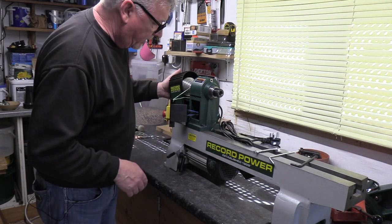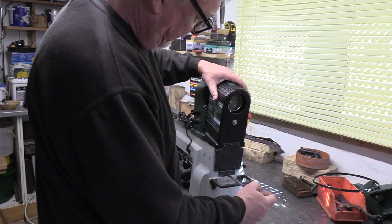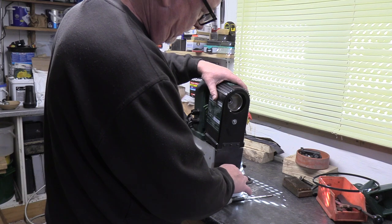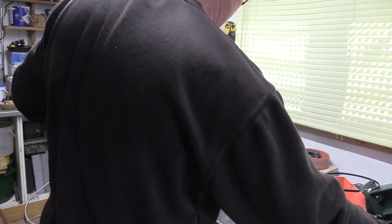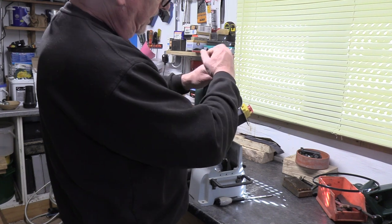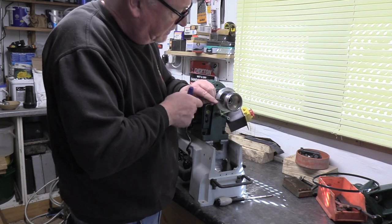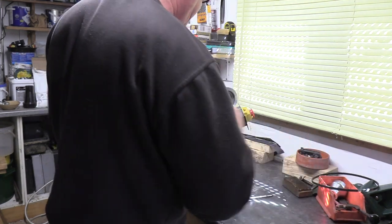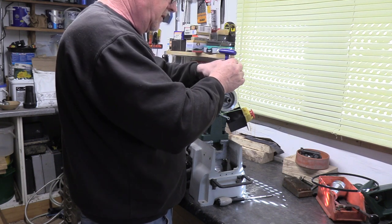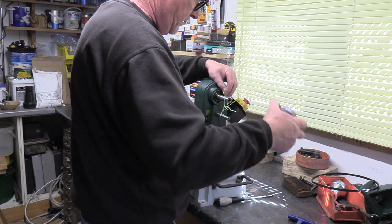The next step really is to move this round. So I want to remove this cover now — I've already taken off a couple of the screws. If you undo it from the casting you haven't got to bother with the nuts and everything inside. So first off is your handwheel — ease that one off and the one on the other side. That should come out. Then you've got your actual pulley itself. You've got a grub screw in there — take that off and take the grub screw out of the way so we can find the location hole afterwards.